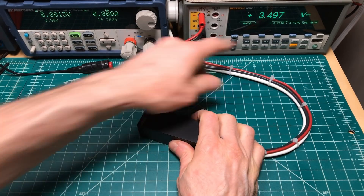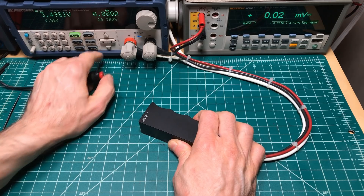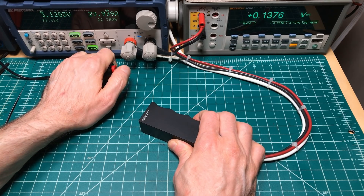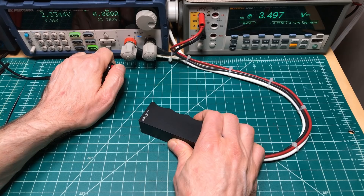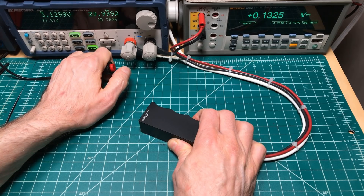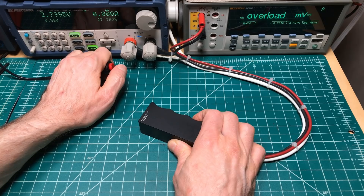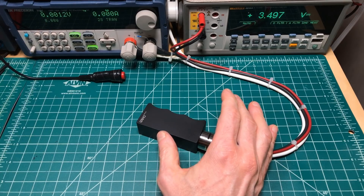Confirmed zero volts when button is pressed. Firing a two-second pulse — 0.41... 0.137... 0.132... moving my finger around a little bit: 0.14... 0.132... 0.129, maybe getting down a slight high point, 0.133... 0.135. Since I got a couple 0.14s, I'll call it 0.135 after cleaning.